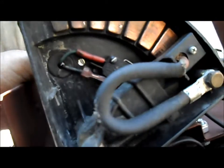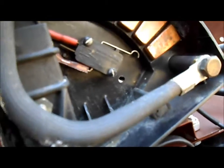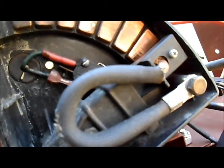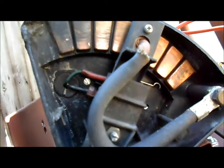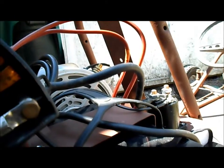It had a little light click you could barely hear. I also noticed that as you moved our slider, it turns on this switch down in here. And when I went to the off position, it turned the switch on and that went to our solenoid. But when I shifted it up to turn the switch on, I was having arcing up here, and the solenoid wasn't working right.